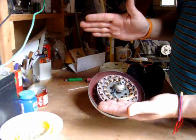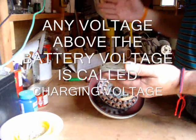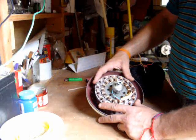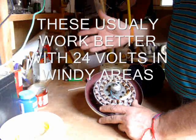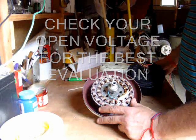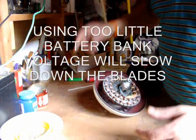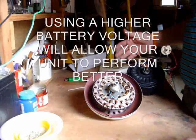12 volts — if you're putting 15 volts in, then you're only putting 3 volts above your battery voltage, and that creates your charging. If I'm putting 24 volts in, it's going to throw more amps in. When you find out what your total voltage is, go buy some $20 lawn tractor batteries and start putting them in series until you get anywhere within 10 to 15 volts below your output voltage. As the wind puts more amps in, the draw on the batteries is going to slow it down a little. I haven't blown one yet, though I have ruined a coil while doing all this.